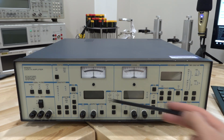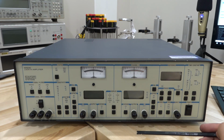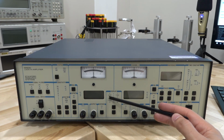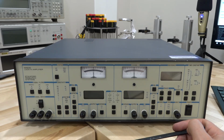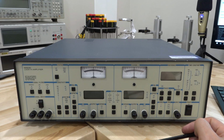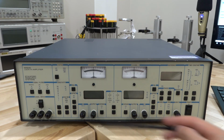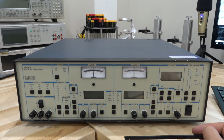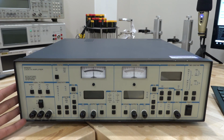We have 2 outputs over here, output X and output Y, which are R cosine theta and R sine theta, and both are available to us. We can change the display to show XY, offsets, the magnitude and the phase, and a whole bunch of other things. Pretty awesome stuff. Our channel 1, channel 2 meters are there, and of course the digital value being selected over here, and other things like expanding the range and the dynamic expansion. I'm not going to go into too much detail, but this is a very nice, classic architecture for a lock-in amplifier. Very famous unit. Too bad we don't have the latest one, but this is going to be just fine.